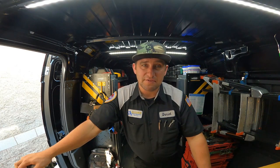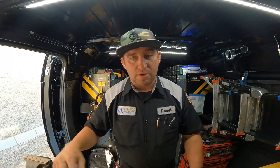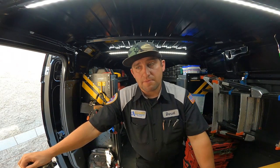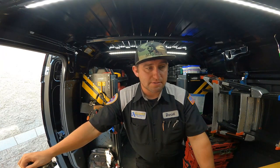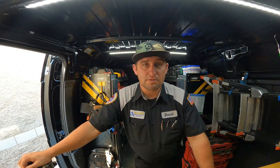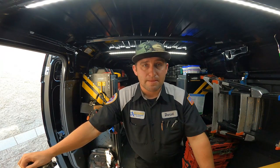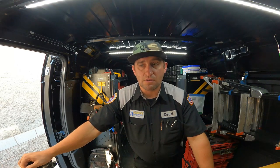But like you saw in my last video on the BAC Trillium style condensers, the fan fell off and destroyed the coils. I'm going to be putting those same brackets on these fans, just to protect them from future failure. I already have the material. I just have to come and put those on another PM time. You just cut them to length and zip them in, protect your coils.